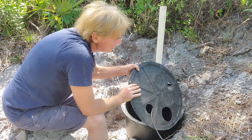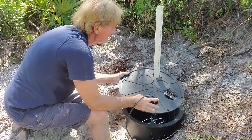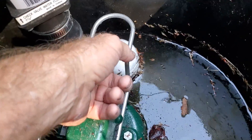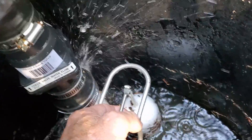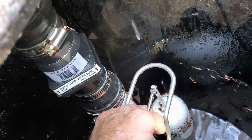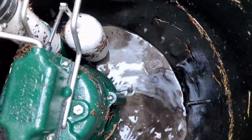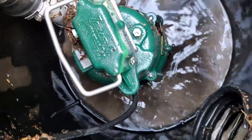Test your drainage knowledge — why is that sand on one side of the basin? Have you figured it out yet? Remember, when I lift up this float, you'll see it looks like a leak — that's the pressure relief valve. Some water does come back out into the basin. And you'll notice all the sand is on that side of the basin. That's why the sand is there, because there's a pressure relief valve. I had to think about that because I had mentioned I don't know why — but now we do.